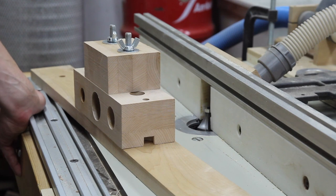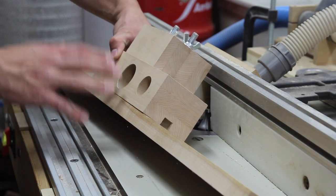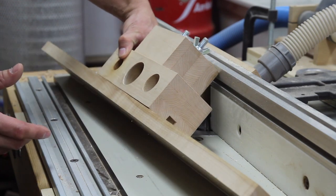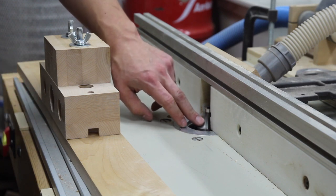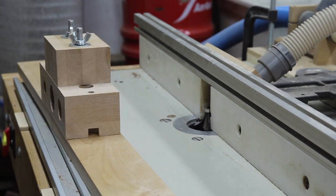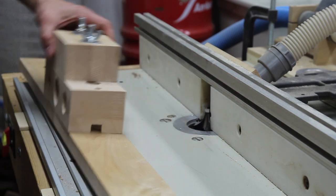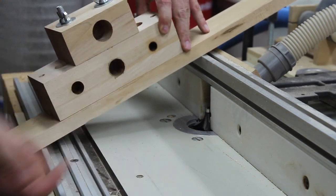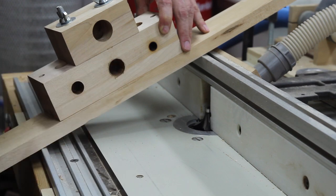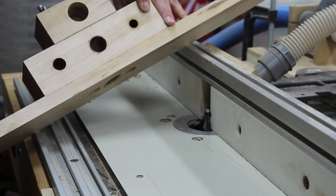Speaking of tricky cuts, making the dowel took a lot of trial. That dowel started out as a piece of square stock, and I ended up drilling a hole and chucking it in a drill so I could spin the square dowel through one of these holes. You size the square dowel just perfectly to fit through the hole, and as you spin it you'll have a router in here — a simple bit like this one. You adjust it to shave off the square dowel so that when it comes out the other side it ends up being round. Using a lot of wax, a lot of trial and error, and more patience than I sometimes have, I was able to turn out that perfect one inch black walnut dowel.